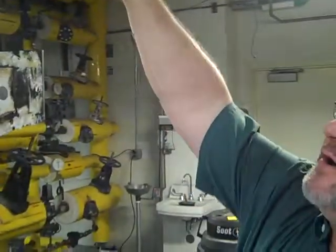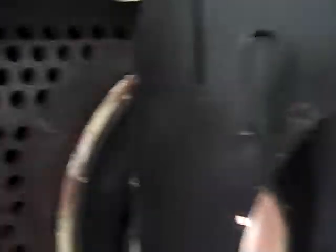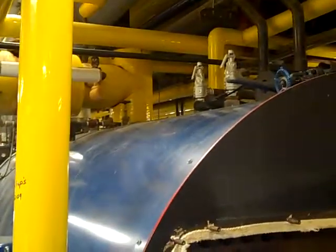You can't see it from here, but up on top there's a large opening into the wet side of the boiler. We have to wash down the outside of those tubes that are on the inside of the wet boiler. We have to wash all of the deposits off the tubes down into the bottom. And then we have to give this boiler an enema from one end to the other and wash out all the deposits. Yeah, it gets a little dirty.